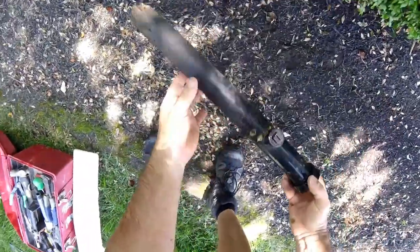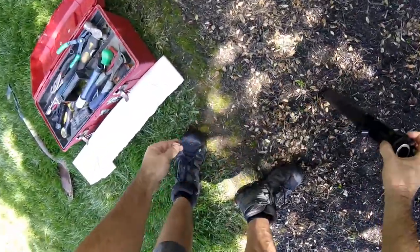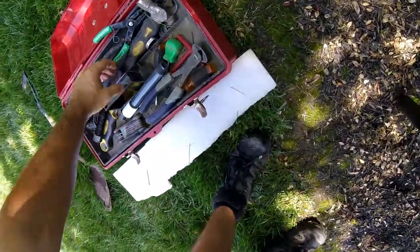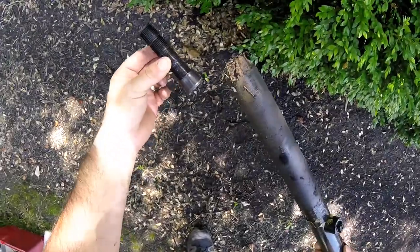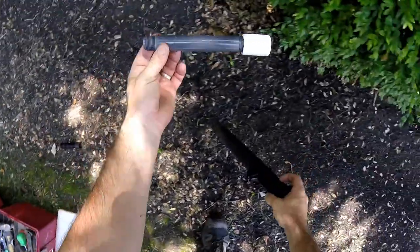You see this is much longer, but it's set up just the same as the other one. So instead of using one of those lightweight risers, we'll raise it up quite a bit — and those aren't very sturdy. So we're gonna use a rigid riser pipe.